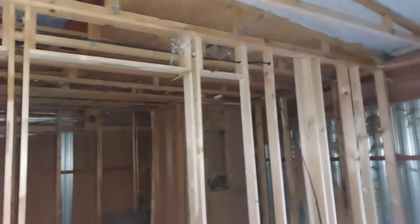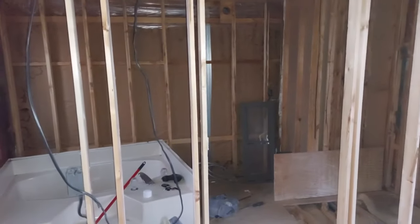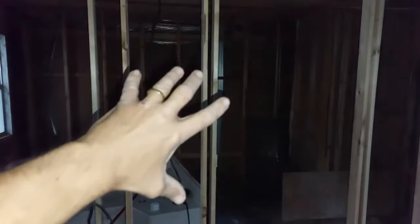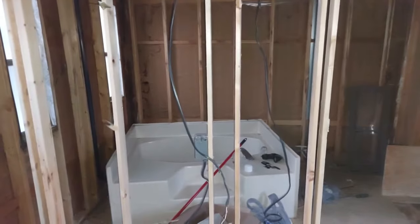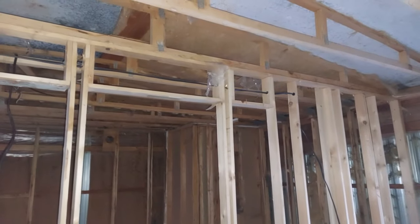There's some work I have to do in the breaker panel to make it more usable. They had this room — the septic circulator and a couple other things — running on just one breaker and that's not enough. So I'm going to split it: one for the bathroom, one for the bedroom. All the plugs and lighting in the bathroom will be on one breaker, and everything in the bedroom on another, so I can shut them down independently. We're going to be upgrading our electrical panel most likely — it just does not hold enough breakers to make this work. Alright guys, thank you for watching — it might be a snap or it might be a new video.